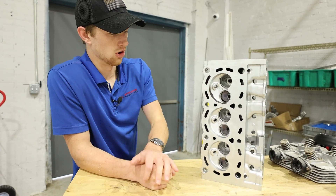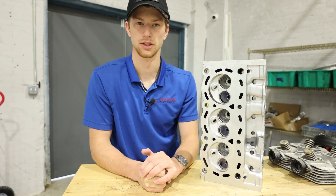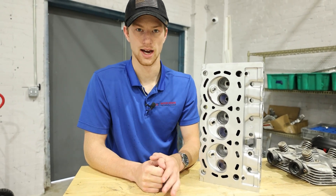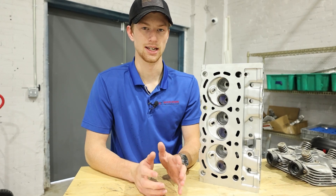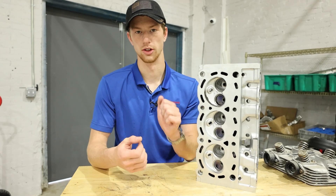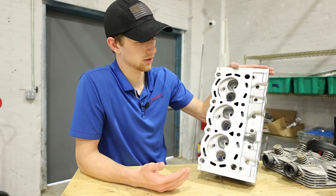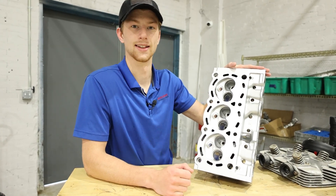As far as post treatment goes with a part like this, we obviously recommend that you rinse it, dry it, and put this thing in a dunk tank if you can — a dunk tank is literally just a bucket of water that you put this in and move it around to try and get the rest of that abrasive out of it. If you have an ultrasonic cleaner that you'd like to deploy on this, that would be an excellent option as well.